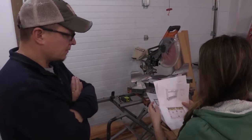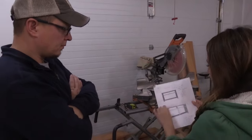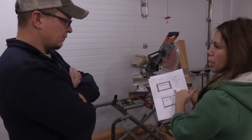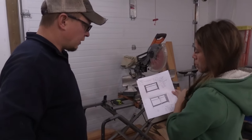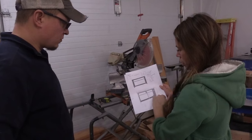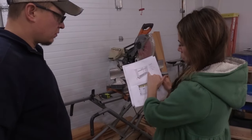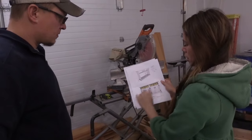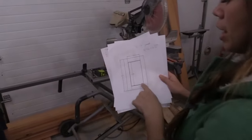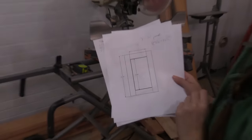We're not short on space. The steps I have are: just build a carcass using the plywood, Kreg jig it together - real simple - and then use 1x2s to build a face frame, then add the 1x4 base around the bottom, and then build the doors. I have some ideas on how we can make building the doors a little bit easier and still get a nice door.